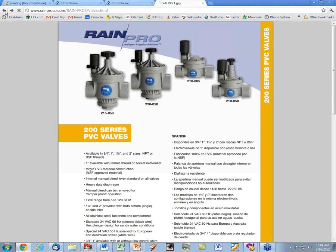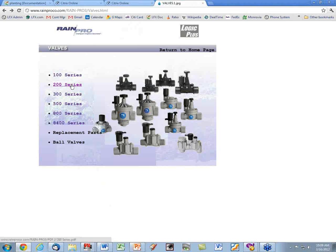Okay, and we have a question from a user. It says, can you buy the pop-up gut separately, or do you have to buy the whole assembly? Oh, that's a great question. You can buy it as just an assembly, but what we suggest is you buy it as an entire unit. When you pull out the original 6-inch internal part of, let's say, an 1806, where do you put it? If you buy the entire 913T, you pull out its internal assembly, drop it into the 1806, take the 1806 internals, put them into the leftover body, and you now have an 1806 pop-up that's good to go on your next repair job. Does that make sense? That makes sense.